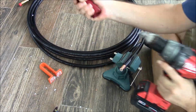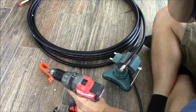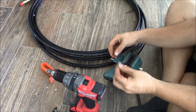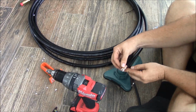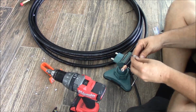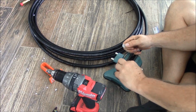Now you take your cutter head off of your tool, and then you have your chamfer end on your screw gun. Take your small O-ring and place it on the 5th corrugation. Then apply some silicone lubricant to the O-ring.